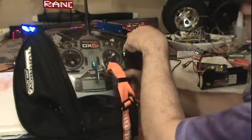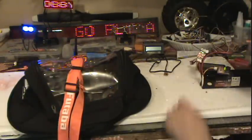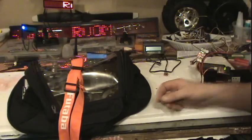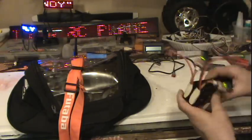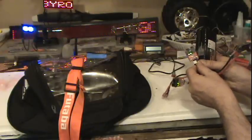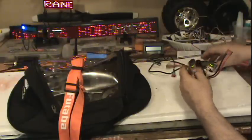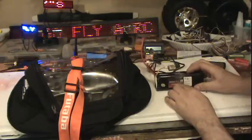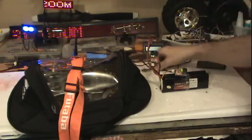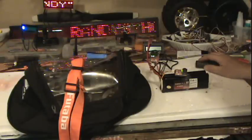But if you see on top here, inside, I have my thermostat taped directly to the top of my heat tape. That's very important. Otherwise it'll get too hot in your glove. But on the lowest settings, it's quite warm. On the high settings, it just stays on longer before it shuts off, so it isn't going to draw a huge amperage. I have 2 cells here. I use one at a time, so that when one meter says that it's getting low, I can switch over and still have heat for that much more time with the other one. And like I said, you can use 11 volts, they'll heat up even faster, but anywhere from 2 to 3 cell LiPos for the system, and it's great. Keeps your hands really warm. I've flown at 20 below, and my hands stay warm. I don't get any problem with my radio.